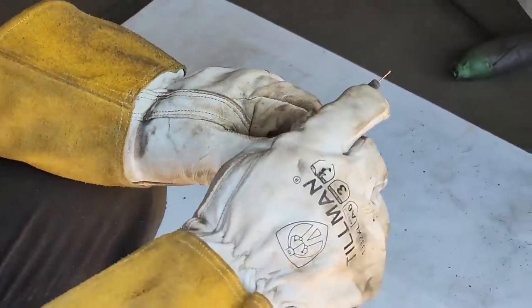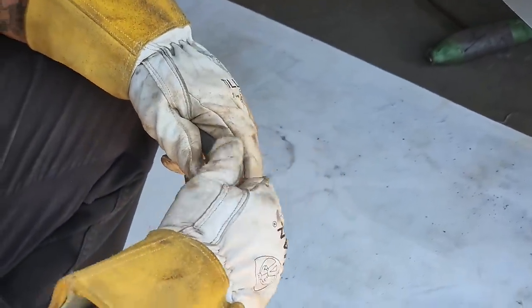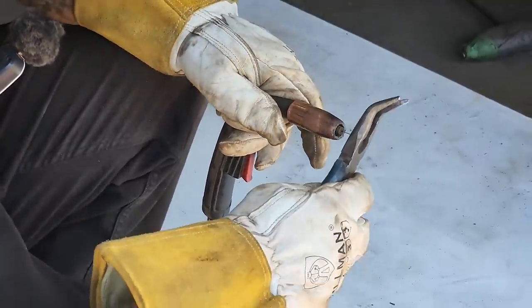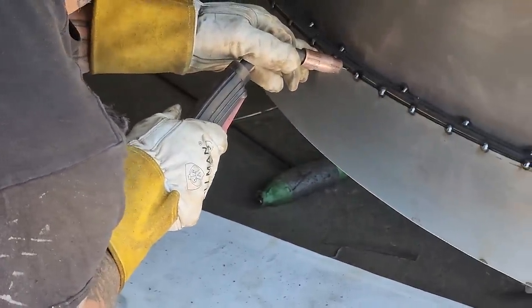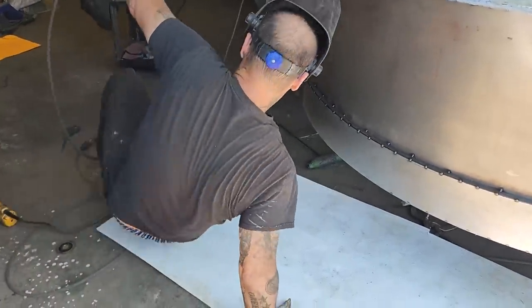That's about the distance away. Nice distance away to start something, right about like that. A little bit long, I suppose. It's nice. Put the wire right where you need to weld it. Pull the trigger. Hold on for one, two, let off. And then put the wire.